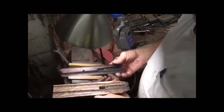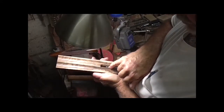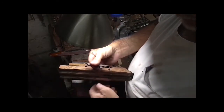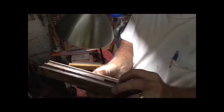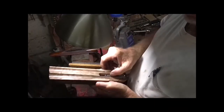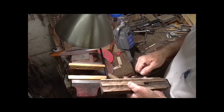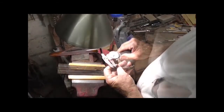What helps me, as much as having the pattern to go by, is the fact that this hole — this front screw hole on the top — lines up with the machine screw that is the back hole of the lever on the bottom. So they connect like so, and these two holes are the same hole: the one here and the one down here are the same hole. So all I've got to do is set my mill up perpendicular to this, drill a hole straight down of the right size, and that lines up my bottom metal. And that's a real plus — to be able to line that up that easily. And that screw is 0.162 and it's centered right there.